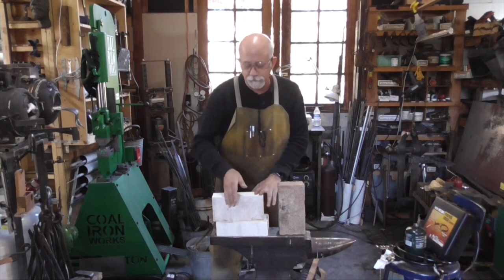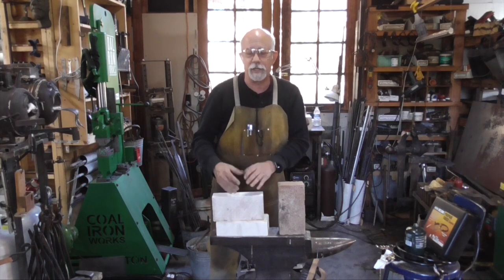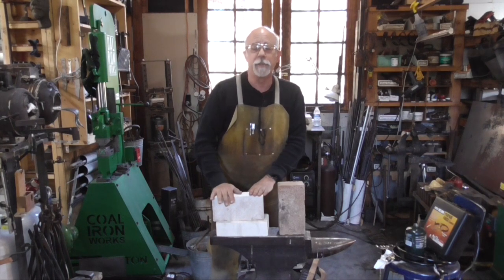The main thing about insulating fire bricks is that they're insulating. Whereas a regular fire brick will soak up heat, the insulating brick will reflect heat — it does not soak it up. If you try to use a regular fire brick, your little torch is going to spend forever trying to get the brick hot before it gets the forge hot. With the insulating brick, the surface gets hot right away but the inside doesn't absorb it — it reflects all that heat into the cavity and it'll get hot within just a few minutes.